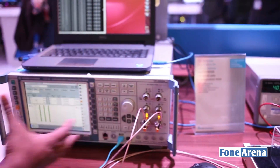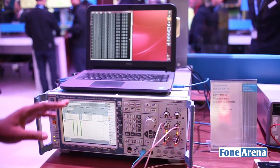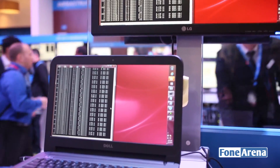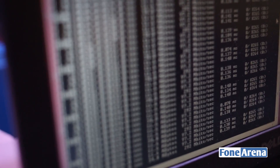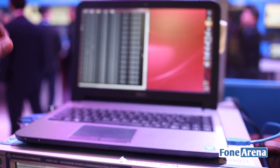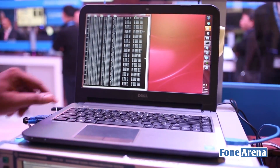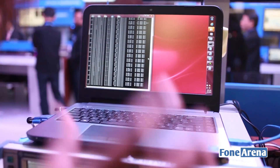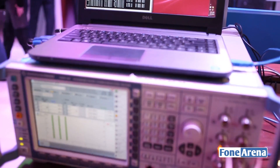This is the base station and what you're seeing here is LTE signaling. In this window you're seeing a throughput of about 292 Mbps. This demonstrates the capability that the X3 C3440 can do LTE Cat 6 speeds, which is 300 Mbps. That's the whole demonstration they are doing here with the phone and the SOFIA LTE modem.